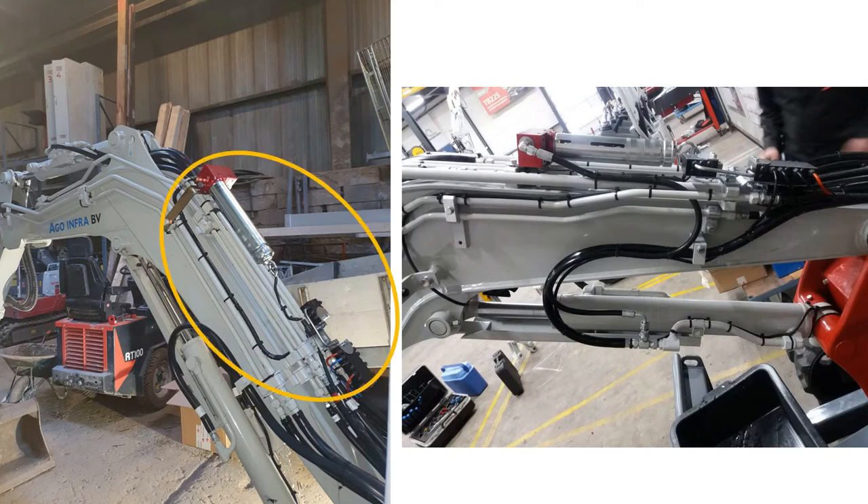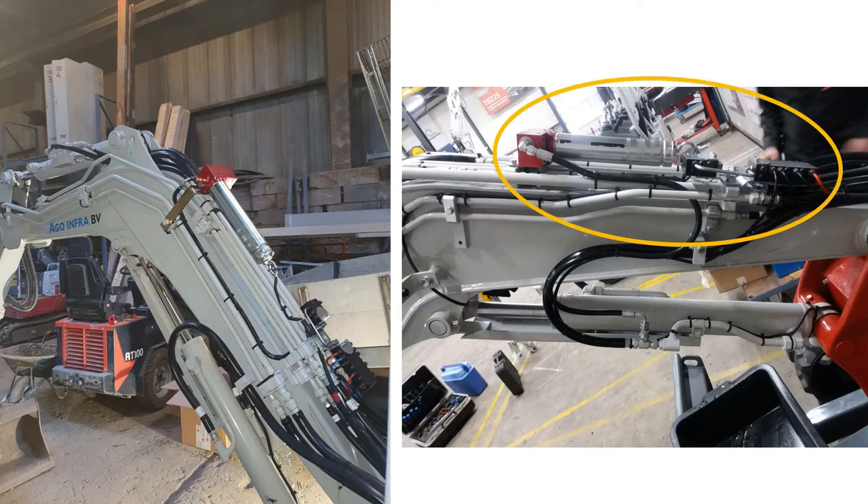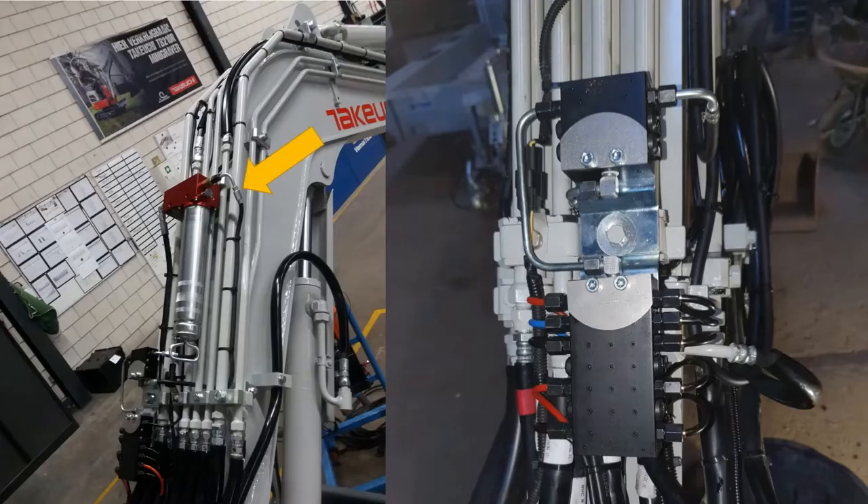Next, we'll take a look at the relation between the pump and the distribution blocks. On the left, you see the grease line coming out of the pump, which flows into the main divider valve for the system. The main divider takes that flow of grease and divides it 50-50 to the two secondary blocks used in this installation.